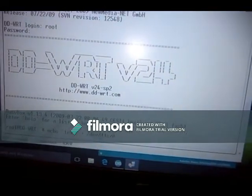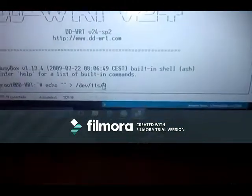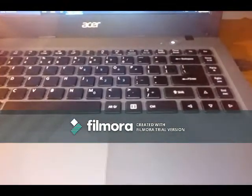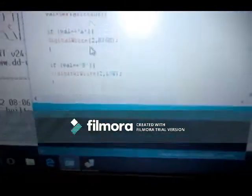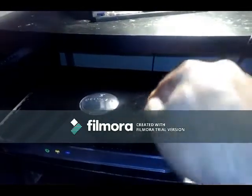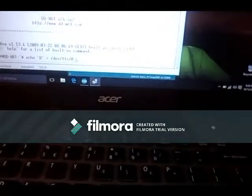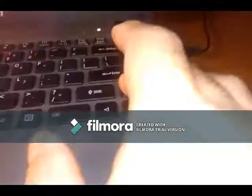I'm going to replace the text with the actual letter A. The letter A in the Arduino — if capital A comes through — is going to set one of the LEDs on, and letter B will turn it off. Here it is: the Arduino receives letter A, and if letter A comes through the serial port it's going to turn on one of the LEDs, which I placed right under this transparent dome in the router — that center light round thing that says Netgear. It's turning on. And to turn it off I type: echo B.